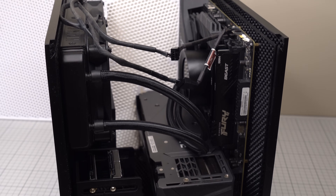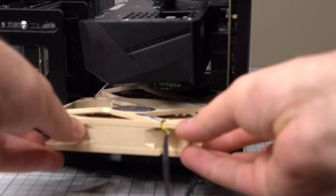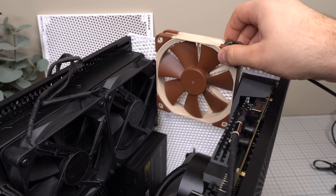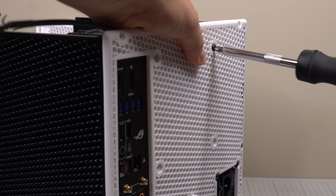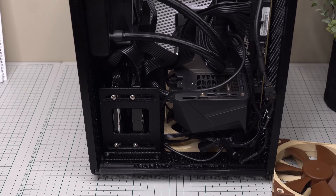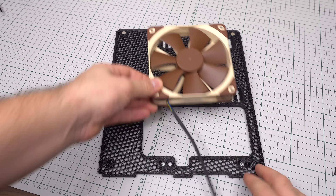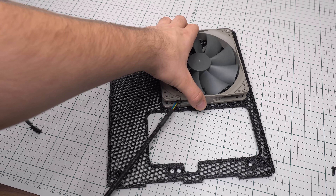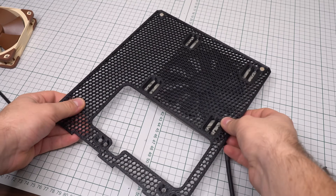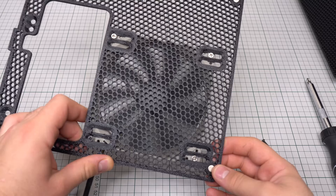When the rear panel is in place, it actually acts as a support for both side panels as well, meaning the top and front panels can easily be slid out, allowing full access to all internal components. If we also want to use bottom intake fans, now is a good time to install them. The bottom panel fits two 120mm fans that drop into place below the GPU and are secured using regular fan screws through the bottom panel. There's also a spot for another 120mm exhaust fan that secures from the rear panel. The front panel can hold an intake fan at the top — either a 120mm or 140mm fan. Originally the design was intended to support another fan at the bottom, but that was changed in the final design due to an issue I didn't catch during designing.